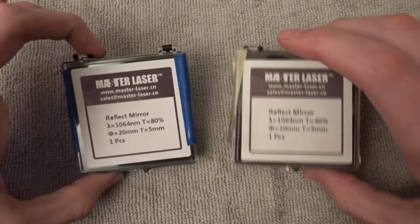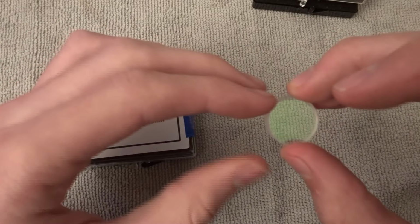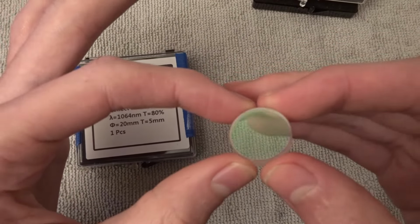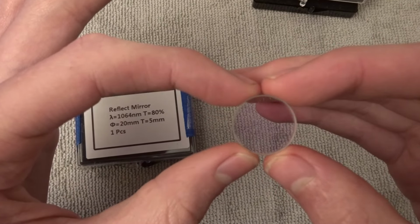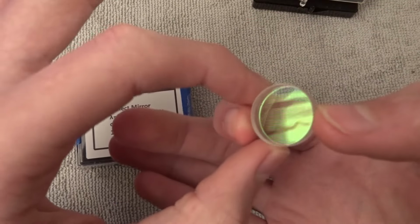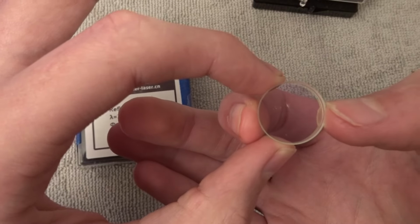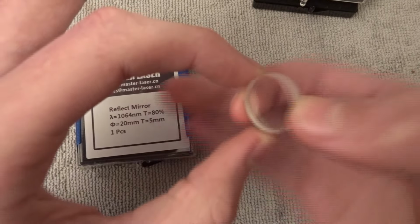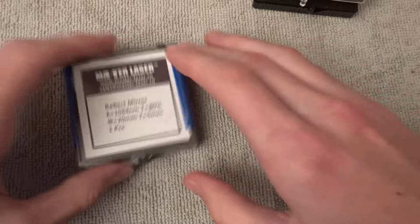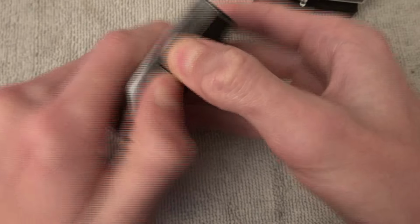As mentioned before, 2 different kinds of mirrors are needed to make a working laser. One that reflects 100% of the light that hits it, called the full reflect or FR, and one that reflects only a fraction of the light and lets the rest of it through, called the output coupler or OC. The gold standard for lasers operating in the frequency of this one are dichroic mirrors. These are basically just very flat pieces of glass with a thin film of metal deposited on one side.